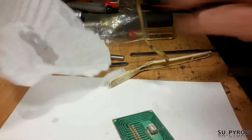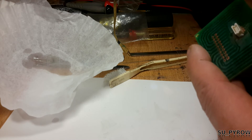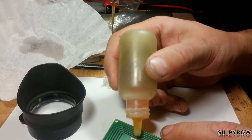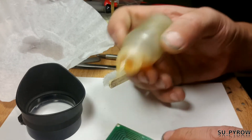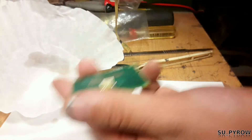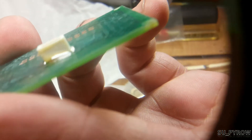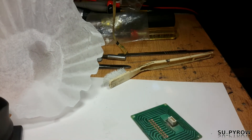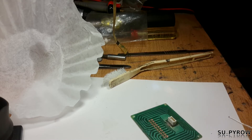I'm going to verify that I haven't damaged any of the pins. We are good. Now flux — this is how much flux I use: it's just saturated in it. That's what you want. You want that wetting action — wetting action is what it's all about. I'll tin my tip and clean it off.